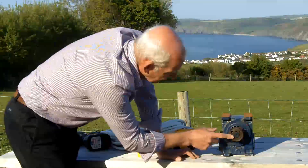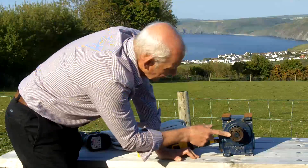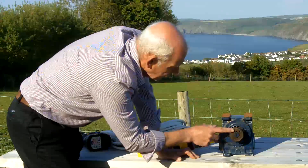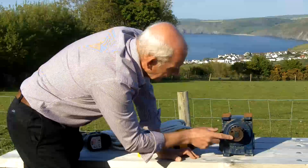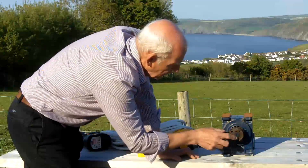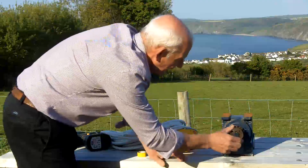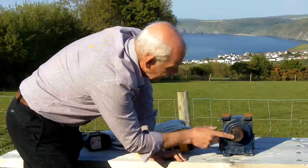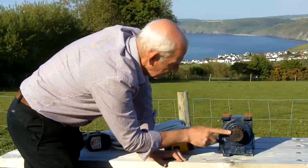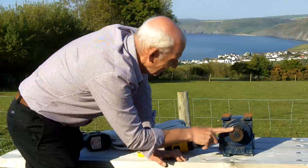I'm going to make this device coupled to the bottom of the antenna. This is what's called a taper lock fitting — it's a two-part fixing with a keyway. You assemble this on the shaft, and the part that's split on the inside, you do up two allen screws which pulls the collar into a taper and locks onto it. I think I'll need to turn that down, but that'll almost certainly be hardened material, so I'll have to anneal it first — I'll just put it in the wood burner to let the hardness out.